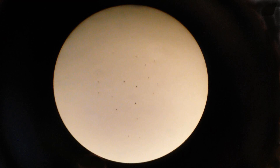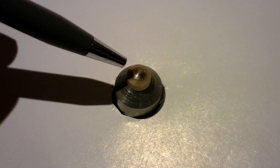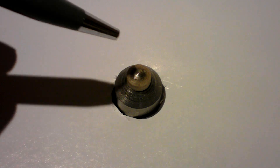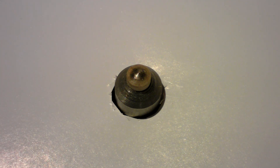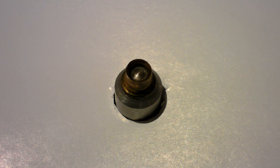Maybe what's happening is that the granules are being moved out of the way, so they aren't heated too much, and if the sparks were forced through the powder, that might be better. Here's an experimental igniter, similar to a spark plug, with a ceramic insulator mounted in a breech plug with a central electrode. If we place a collar around it, we can confine the powder and then force a spark through it. Connecting this up to the stun gun, you can see the sparks inside the chamber.